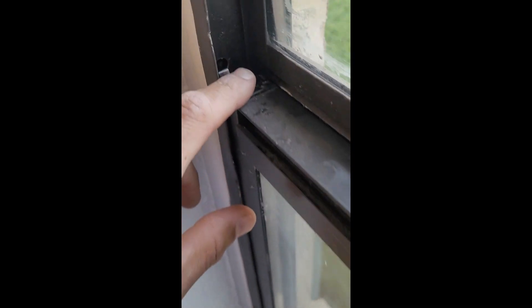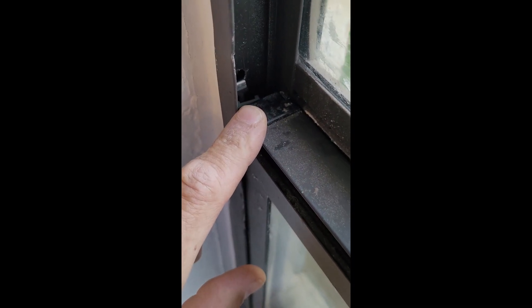On this project we've got a little trifecta happening here. This window is different than the other ones — there are three different types of channel balance here. That's the device that goes down inside to help support the weight of the window when you lift it and also when you push it back down. This one here has a clip on the side. In order to get these in place, this clip has to be up — you can see it's engaged there, and then I can push it back down.